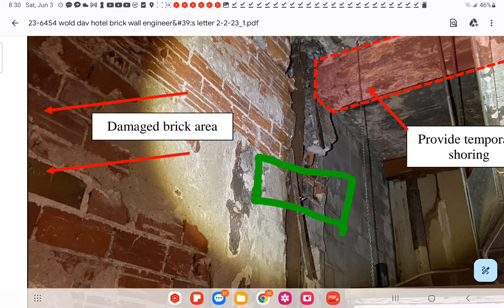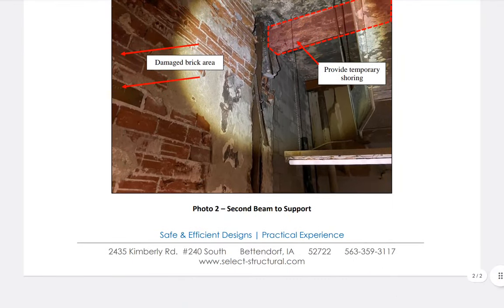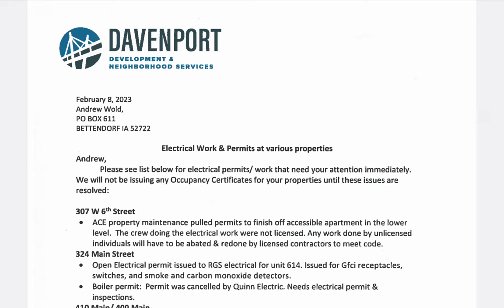Whether they built the block out, toothed it, and came back around to grab the wall — however low-tech — there is no connection between the left side and the west side. I call that a defect, and you're going to see that defect repeated in numerous repairs.